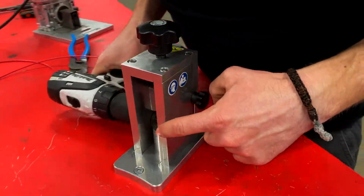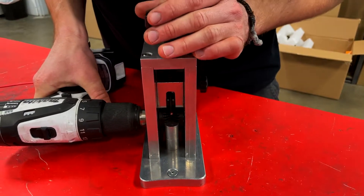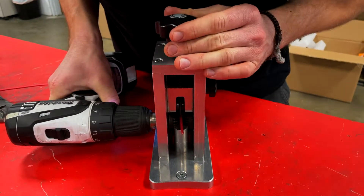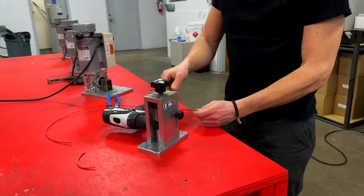It's very simple but very effective. The last step is to get your knife height set correctly. Run the machine slowly and lower the knife until you start to see copper — just like that. Now we can start stripping without any issues.